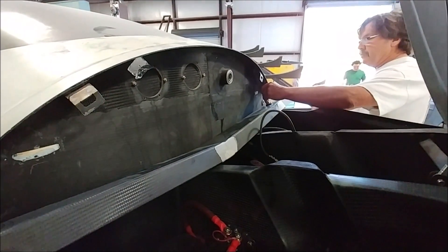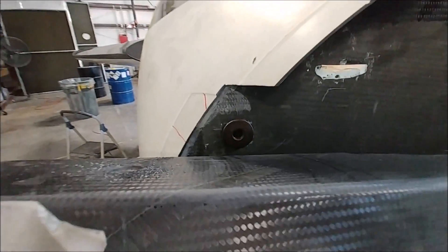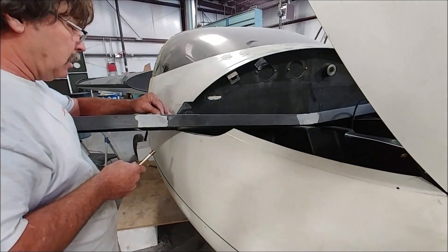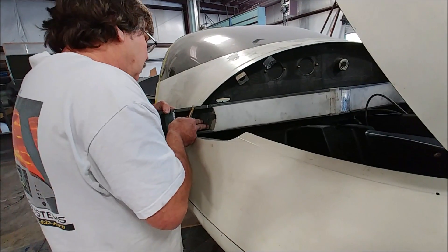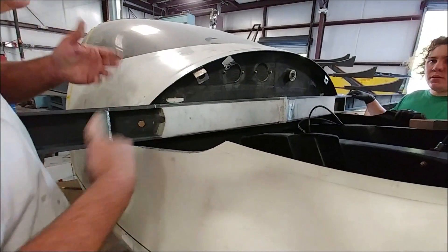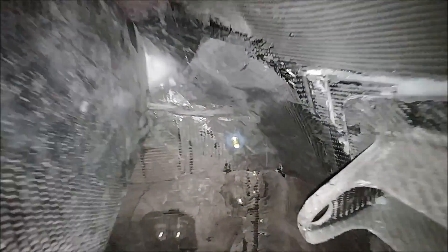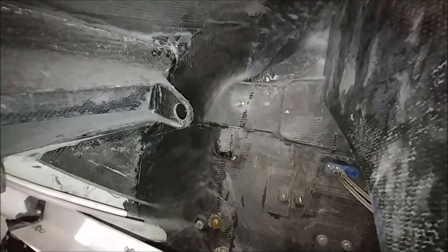Here's Jeff setting up to bond those sleeves in place that hold the fore plane in position. These are the sleeves I made up at Brit's and had him weld those washers to. There's one sitting in the fore bulkhead getting bonded in, and the one in the actual spar was getting bonded as well. Jeff had to make sure they're all nicely aligned and the hardware goes through first before bonding, so the bolts will still come out. He's got nut plates that will be bonded in on the front side of the spar, so when bolts go through from inside the cabin they'll catch the nut plate and hold in place.